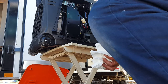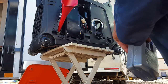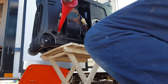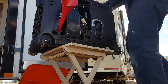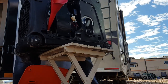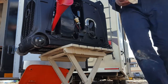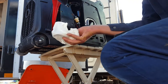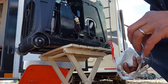I can see oil in there but it is not quite up to the level where the dipstick is going to touch, so I'm going to add some more. Now I'm going to reposition the generator slightly so that we are very close to level — more so than it was a minute ago. I'm going to check. By the way, I forgot to mention — I wear safety goggles because you never know what you're going to get in your eyeballs and you only get one pair.